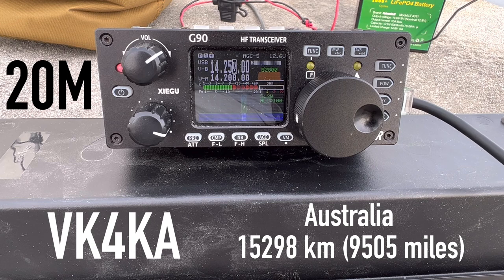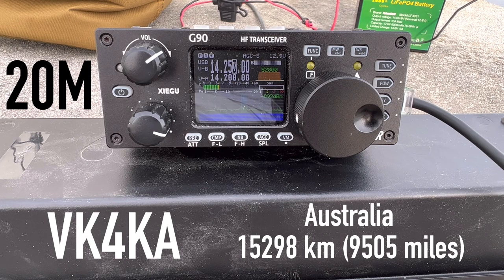I made a vertical end-fed half-wave for 20 meters. I've got the DX Commander 10-meter pole straight up with the wire on it — just speaker wire, 16-gauge speaker wire, 49:1 unun, and I choke it with a balun choke. Then I use a 1-meter-long counterpoise wire, which is 5% of a wavelength. It's up pretty high — I actually have it up on top of a fence. I'm literally a meter from salt water, right beside the water. Corey confirms it's working and says I've got about 298 kilometers between us on the short path, and I'm certainly working hard for 20 watts.